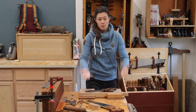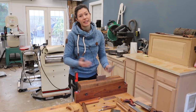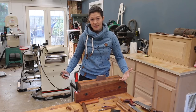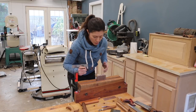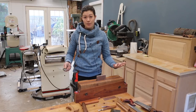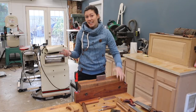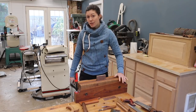Let's talk a little bit about rip cuts, where you're cutting down along the grain. One thing that's really helpful is making sure your board is secured so it won't chatter. The board is in an auxiliary vise here — I have a very low workbench specifically so that my center of gravity is directly over my work when hand planing. However, when you're doing intricate joinery work you don't want to be hunched over your bench, as it will negatively affect your sawing technique. This awesome work-holding tool is called a Moxon vise, and just like the bench hooks it can be as simple or as fancy as you want. Some of the most popular places to get hardware for Moxon vises are Benchcrafted or Texas Heritage Woodworks.